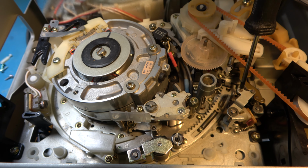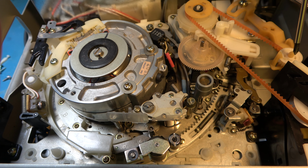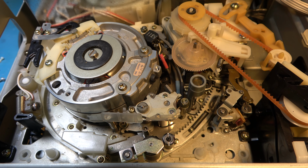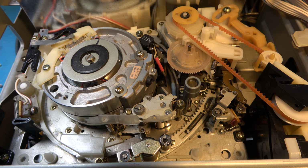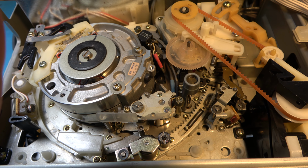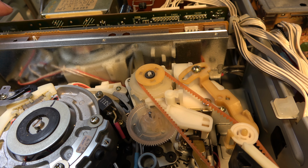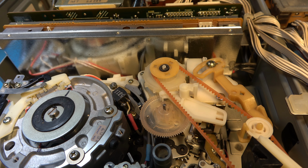But there's always a possibility that we're 1/2 out here, one way or the other. So we'll have to worry about that later when we have power to this. But I don't want to power it up again because it'll start that lacing and unlacing thing, and it could potentially damage itself. So I'm going to wait now until we have the STK5441 regulator component. It may not be that there's a problem with the regulator, but it makes sense to change that. That's on this board here. So we'll change that and then we'll see where we are.